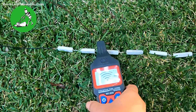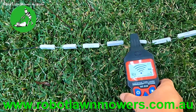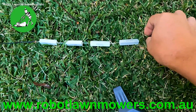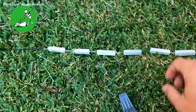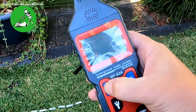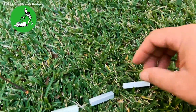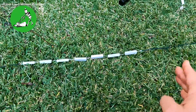There's still signal there — my break is actually in here because I've set this up. Sitting about 15 centimeters off the wire, just go along... and it goes past and stops. So there's no signal there, signal here, no signal there. You can sit here very carefully and go along and find exactly: good connection there, less connection there — our break is right here. If you've got an actual break in the wire, it's really quite simple to find.